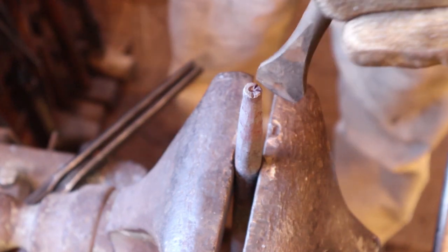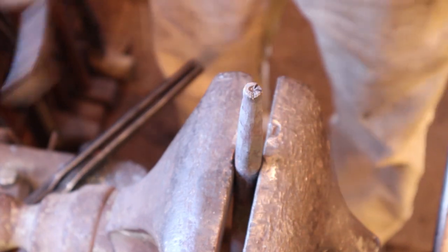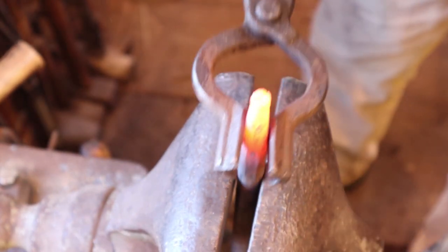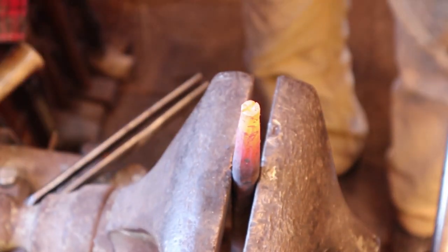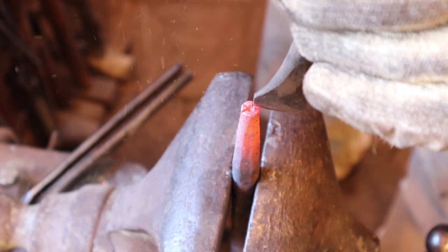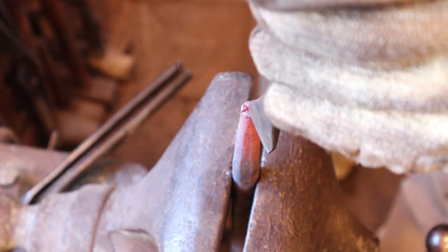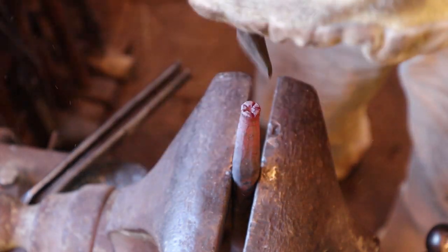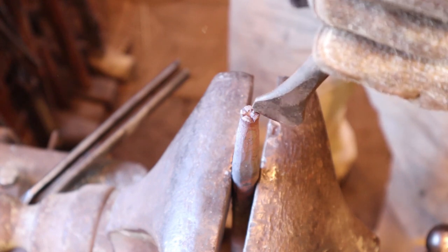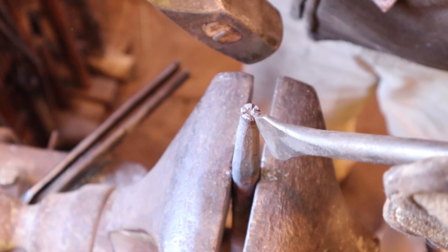You can do a lot of this with a file or a small rotary tool. I don't know if you can get a cutting disc small enough for most die grinders or not, but the one on a Dremel or something like that would probably work. And as you cut deeper, tip towards the outside — that helps create a little wider gap there with your chisel. Because you don't want it real deep in the center, but you want it fairly well defined and opened up some on the outside.